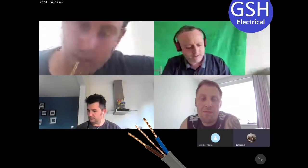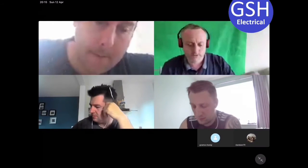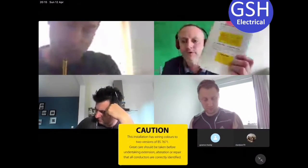However, we are expected to do some sort of indication to the person that follows you into the installation. Anyone know what we're expected to do once we alter a circuit in a domestic dwelling, which is red and black, when we introduce new cable colours? Anyone can answer. Isn't it add a sticker to the consumer unit identifying? Yeah, absolutely. Let's look in the on-site guide then, folks. So let's get our guides out. And we need to go to page 60. Page 60, on-site guide.